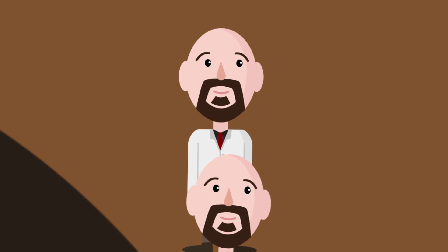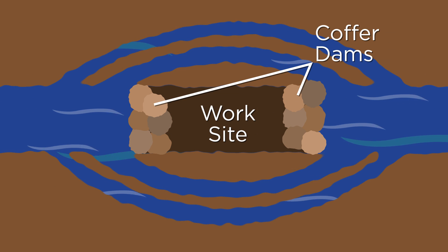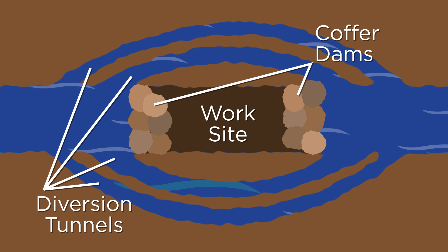This plan involved a whole lot of dynamite. In order to divert the river, the construction crew had to create four tunnels through the canyon. These tunnels had to be 56 feet tall — that's like me standing on my shoulders on top of seven other me's. With all that rock to get through, drilling and digging wasn't going to be enough. Instead, the workers would drill small openings in the rock and place dynamite in the holes. And then, time to blow it up. The crew blasted their way through four tunnels that were 4,000 feet long — that's about as long as 11 football fields. When they were done, the river had a new path it could take around the work site. By dumping rocks and debris in the openings, the crew created temporary coffer dams, which redirected the river into these new diversion tunnels.